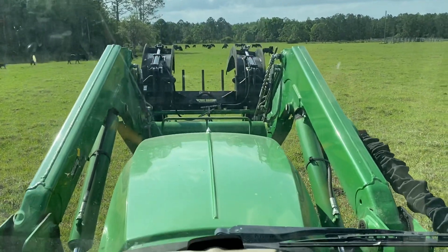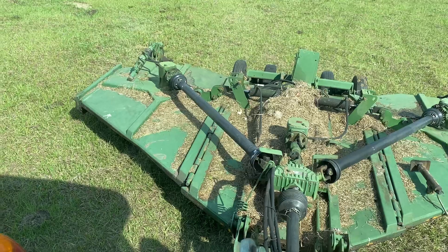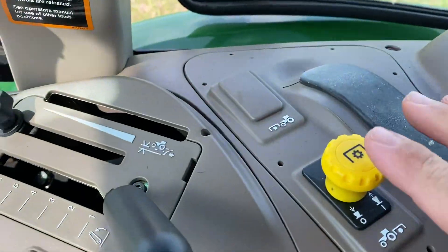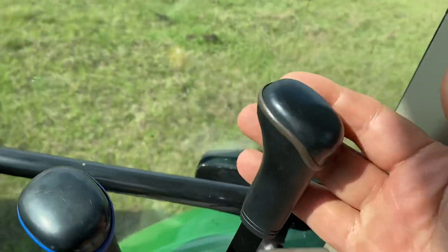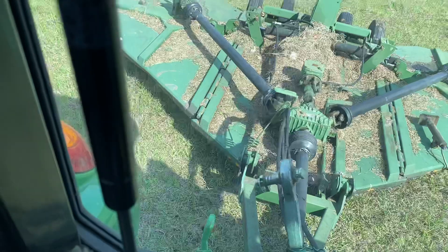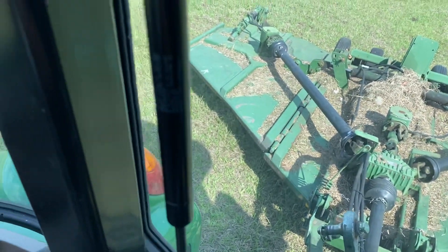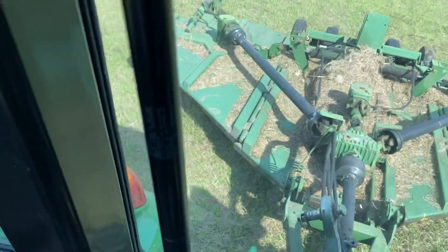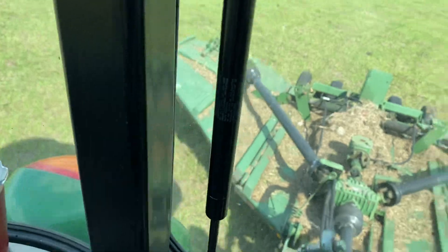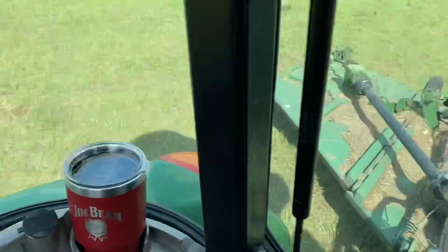Now you know how to operate the claw and the loader. What's hooked to the back of this tractor is our batwing mower — that's an 18-foot batwing mower. It's operated by what's called a PTO and these hydraulic levelers. This lever here, pull it back or push it forward, and you'll see that mower go up and down depending on height or whether we're just transporting. The sides are called batwings — when I pull this lever it'll fold up, push it the other way it'll come down. Same on the other side. That's the type of mower you see guys using on highways or airports.